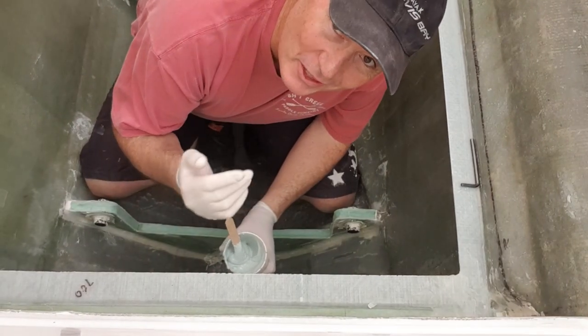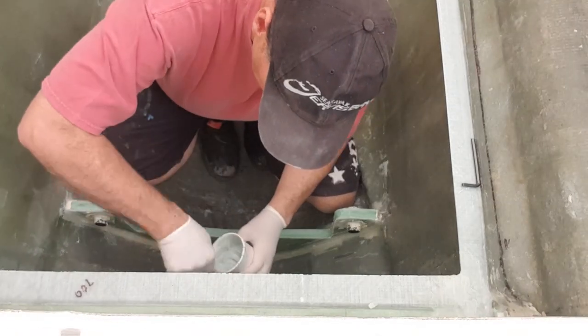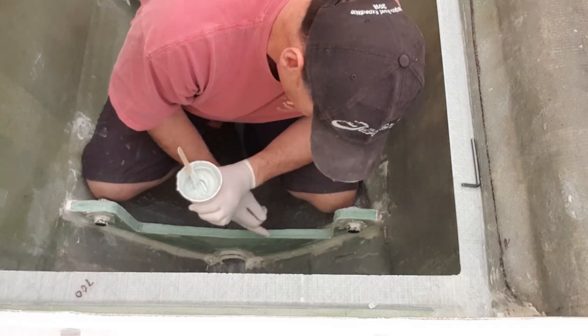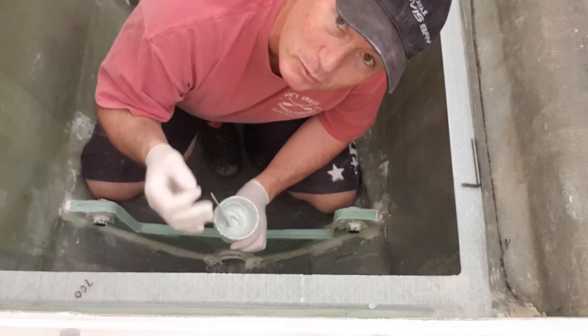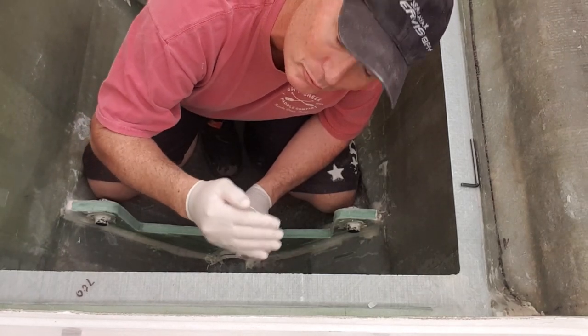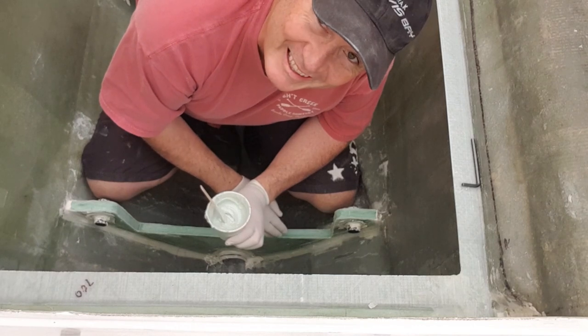Okay, so it's not just good enough to have foam, you need to seal it and then you need to glass over it. So I'm putting in more of this bedding compound along the top of this. I've actually coved it out, so there's plenty of bedding compound in here, and then it's going to be glassed over with two layers of 600 double glass to strengthen it before I put in the slats